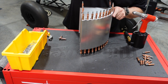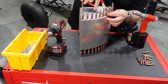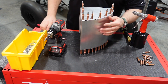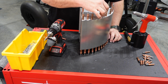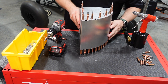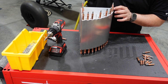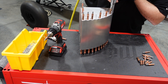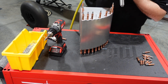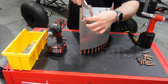Most of these are going in okay — just a little bit of cleanup needed, nothing major. Basically just like any other item on the plane that you're riveting together, try to keep the sheet metal adhered to whatever bracket you're riveting it to as tight as you can. In this case we have a curve, so now that we have it all tightened up, we go ahead and start riveting — simply going along this edge. Once you get every other rivet in, you go back, take the Clicos out, and finish up the rest of those rivets.